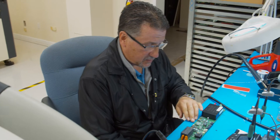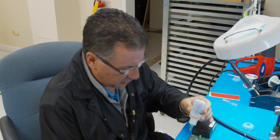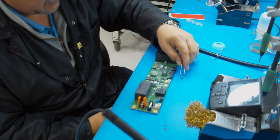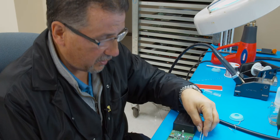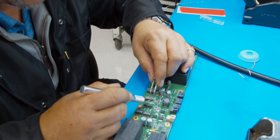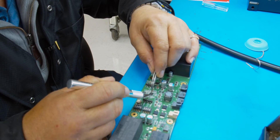Once you have your lands prepared and it's time to replace the leadless IC, I like to put a tiny bit of flux on the ground pad. This leadless IC happens to have a ground pad on it, as you can see. It's important of course to make sure that you have the right orientation. I take my leadless IC, put it where it belongs, and now I'm going to work on getting it centered.